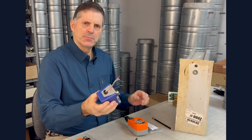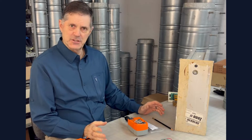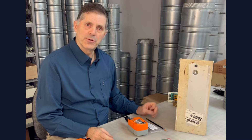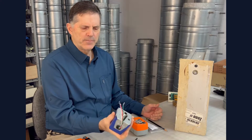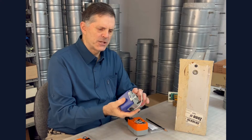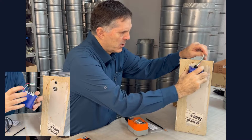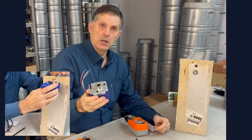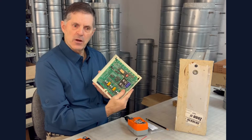The next option is moving up to a three-wire motor. A three-wire motor only pulls power when it's opening and closing — it doesn't use any power unless the damper blade is moving. Therefore it never gets even warm to the touch, and the reliability tends to be longer. This one is our RZ135-7 on our website. Like all common footprint motors, it's going to just fall into place — very easy to install. It is open-close only and you do need to have a zone control panel that supports a three-wire damper.